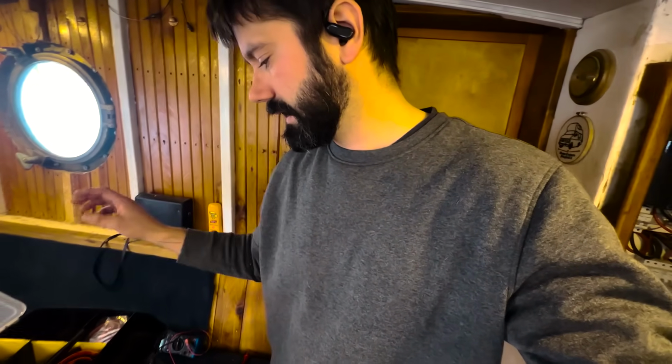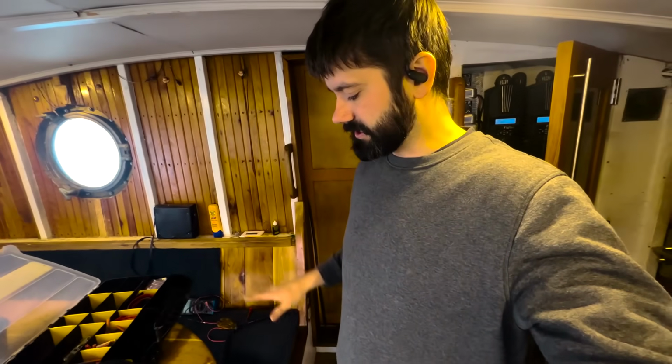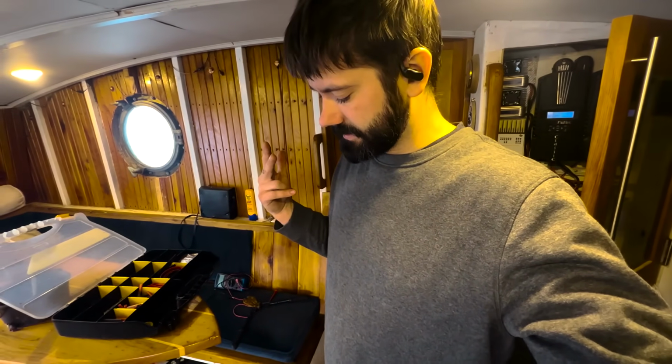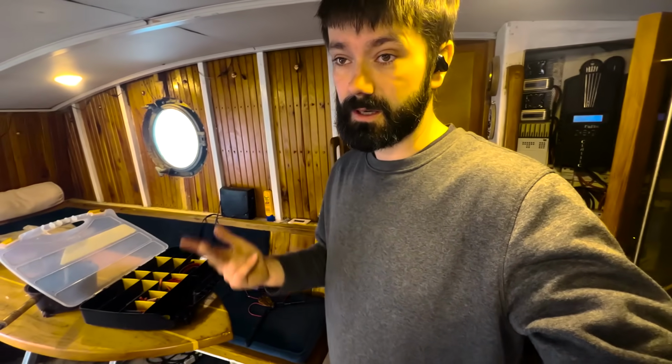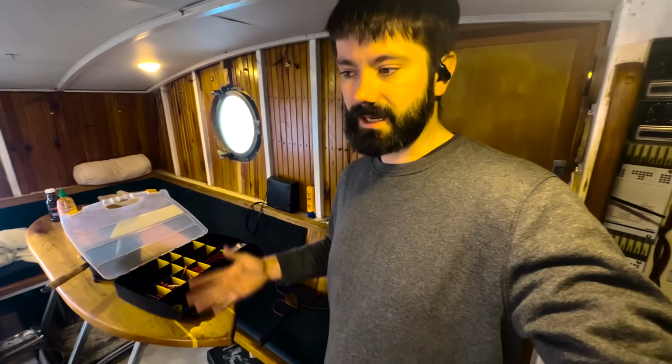Old Dog's a mess right now because I'm focusing my energy on Perry. We're just going to get this thing installed in here alongside and parallel with my other bank. They're the same chemistry, same cell orientation, same voltage, same everything. I'm just wanting to see how they compare to each other. Mine only has like 1 temperature sensor, I think maybe 2, and doesn't even have self-balancing, which is really annoying. It has no control screen, no communications, no nothing. So it really is a dumb box to put alongside this nice smart box.